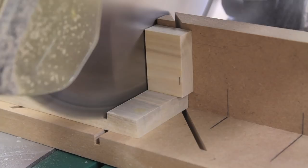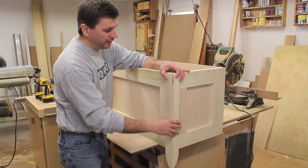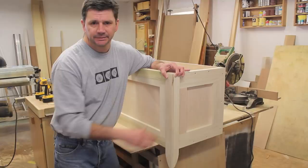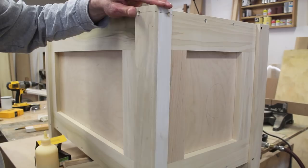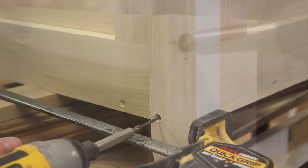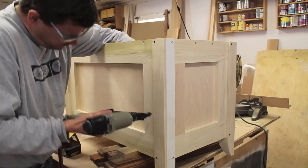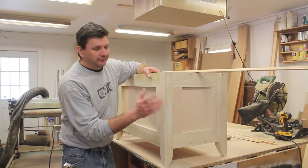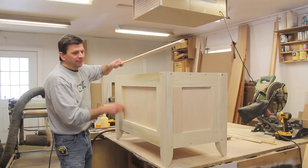I just finished trimming the legs flush with the top of the cabinet. That's why I held back a little bit when I nailed the leg together — I held back about two and a half inches so I was clear of the saw when I went to trim the leg for its final fit. I used inch-and-a-quarter screws, a few nails, and some wood glue to attach the legs, and the next step is to start trimming out these panels using a small base cap molding.